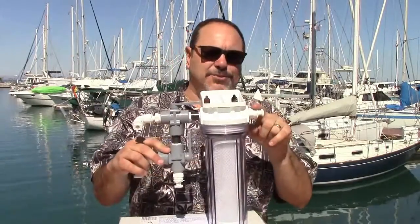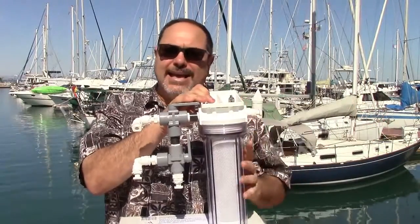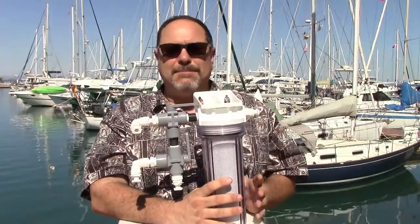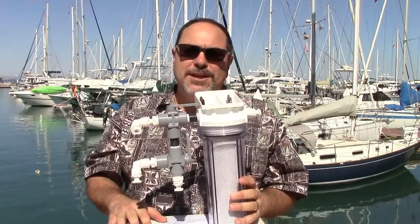You can connect this directly to your ship's water tank, or more commonly people tee into their pressurized galley water and have their ship's boost pump push into our system. The advantage is that it's easier to tap in with a tee on your pressurized galley system. The downside is that you'll need to always have your pressurized ship water pressure pump on when doing a fresh water flush — and if you have the automatic fresh water flush, that means leaving it on when you leave the boat.